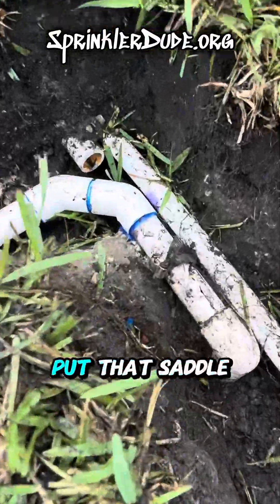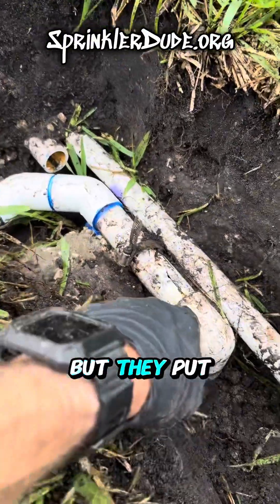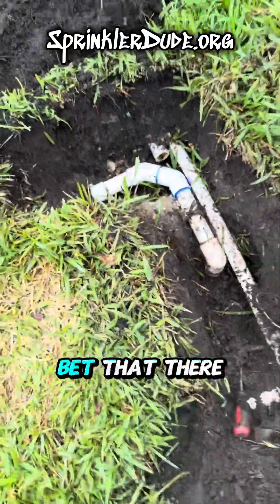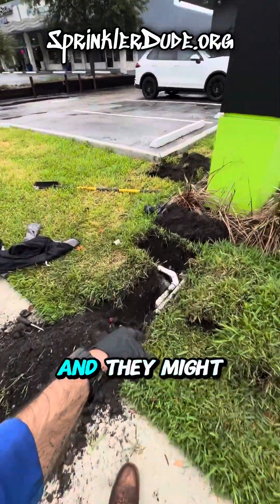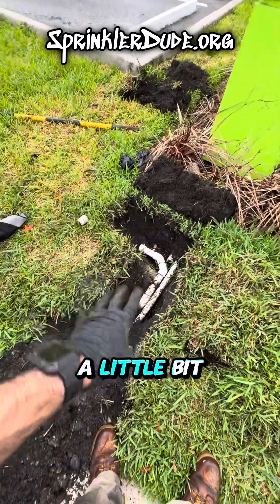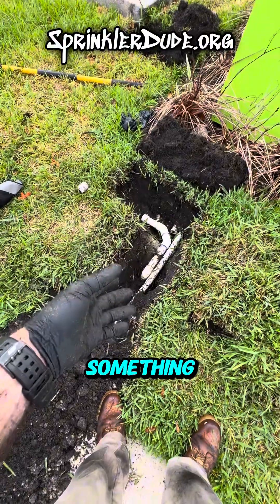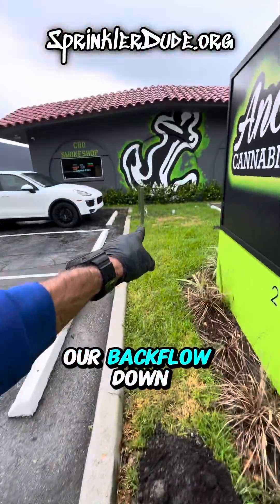I figured out why they put that saddle there. What looks like a coupling — they put it here because there was a crack at this wood post, and right below it is concrete. I'm willing to bet there was a for-sale sign or something right here in front of the property and they broke the pipe when they did that, then used that saddle to put it back together. So we're going to have to do a little more digging to get down to the galvanized fitting where it goes from galvanized to PVC, so we can screw in a new nipple or male adapter, come back up, and then plumb it into the one-inch line that's running to our backflow down there.